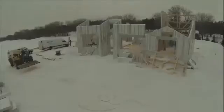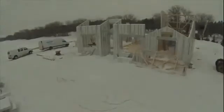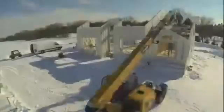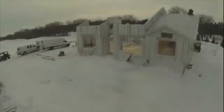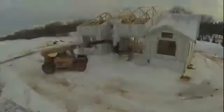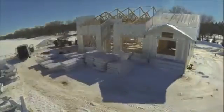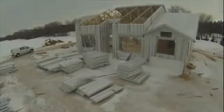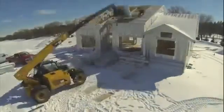Say you were building a 40-foot wall with the ThermoSteel panels and you put four openings in it — whether doors or windows, it wouldn't make any difference. You would be handling a total of 10 pieces. Each panel is four feet wide and can be whatever length you'd like. In conventional construction, think of the number of studs you're going to have — one every 16 inches that you'll have to install.